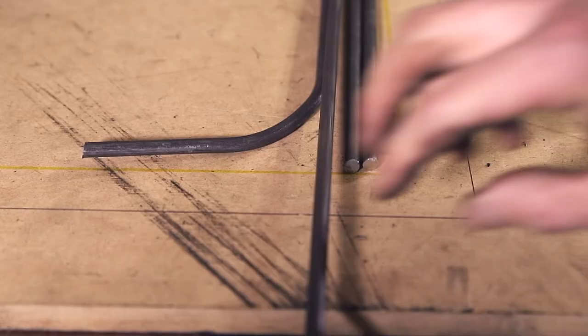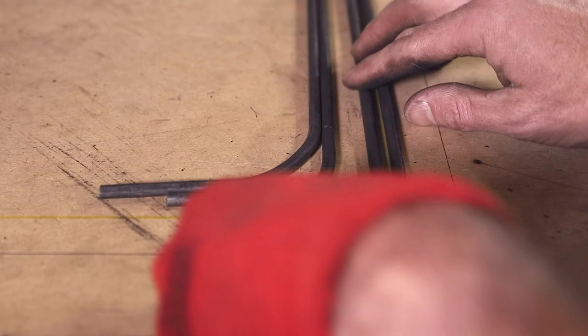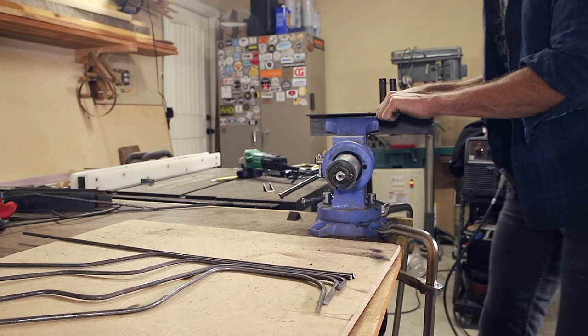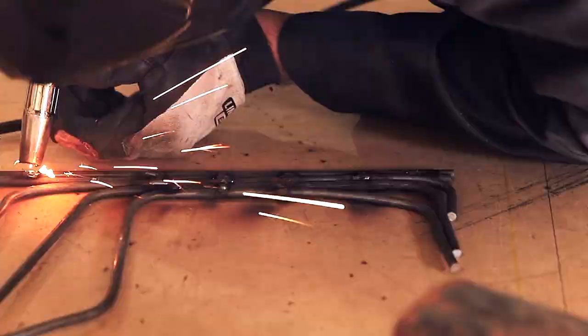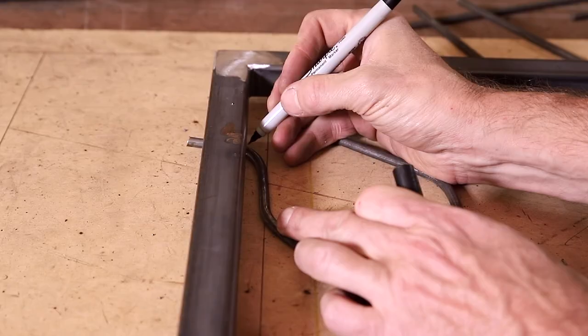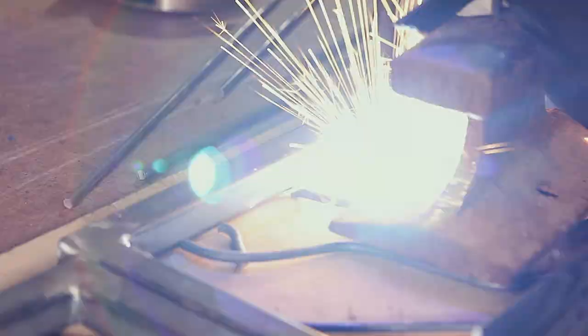Each frame will contain one half of the tree on either side, and each one of these is made from five pieces of this quarter-inch steel rod. I started by bending the roots and working my way from the outside in as I bent the branches into a tree shape one-by-one. With the first side of the tree complete, it could serve as a template for the second side. I intentionally made the other side just a little bit uneven because I didn't want it perfectly symmetrical. With both sides of the tree done, I could line up the bottom and then start welding them together piece by piece.